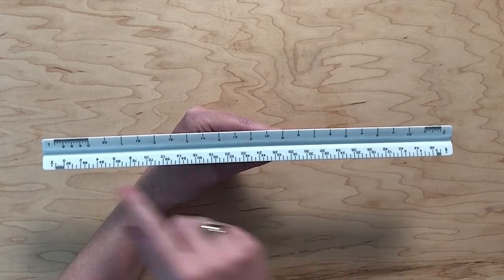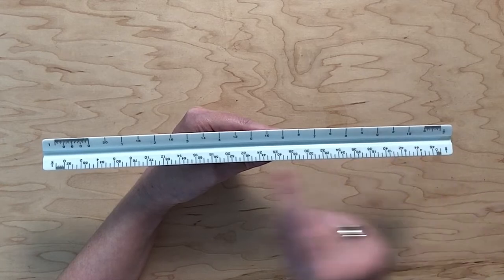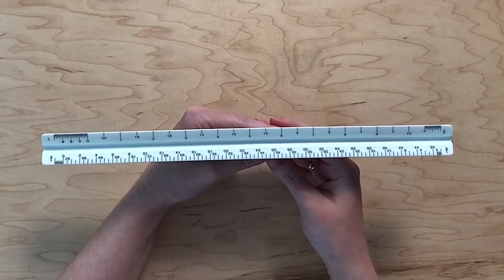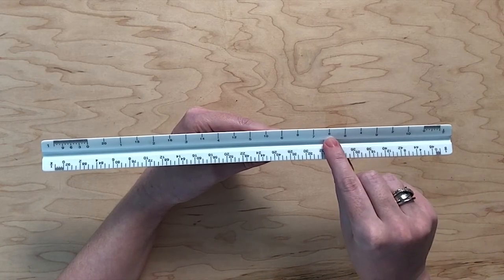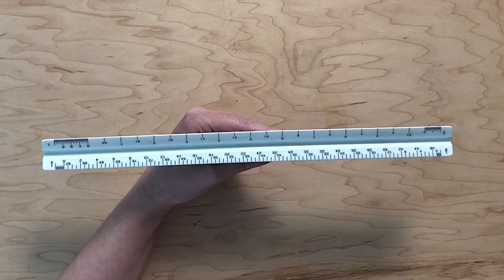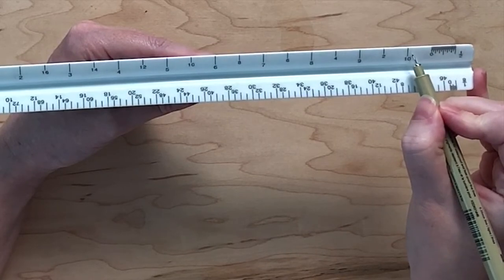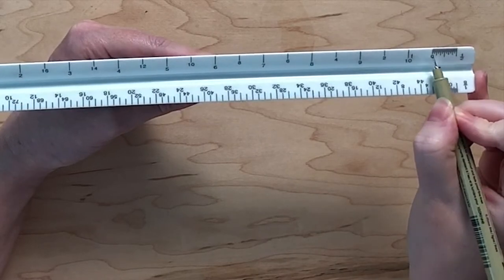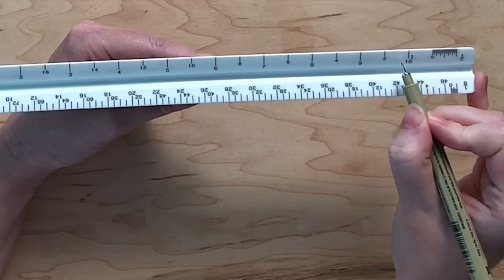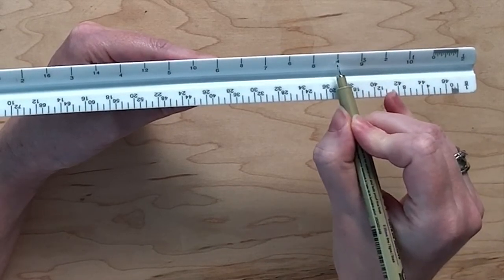The two scales on each side are related. The smaller scale is half of the larger scale, or the larger scale is double the smaller scale. The smaller scale marks feet on the top row of numbers using a smaller size label, and each line after the zero represents one foot. For example, in the 1/2 inch scale — meaning every one-half inch drawn is one foot in real life — we can see one foot, two feet, three feet, four feet, and so on.